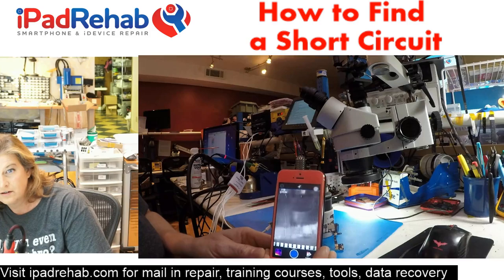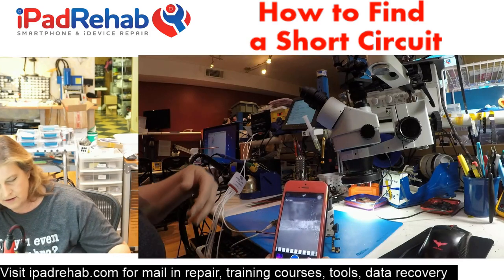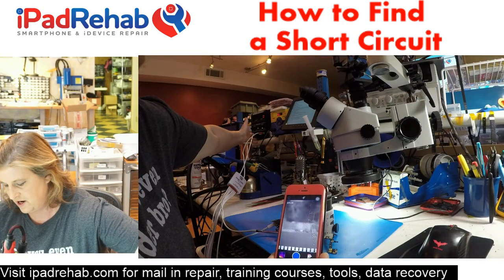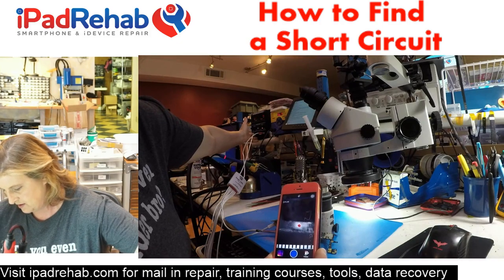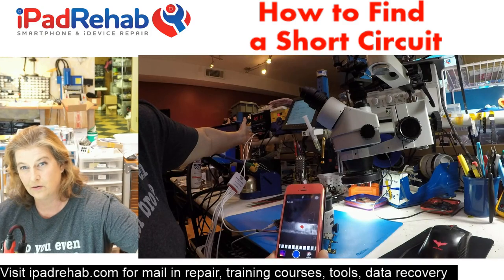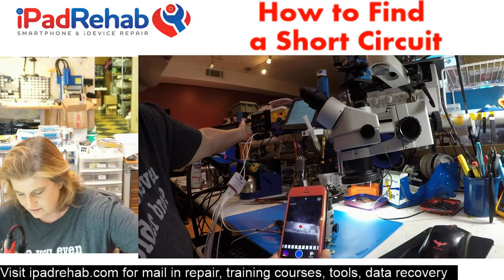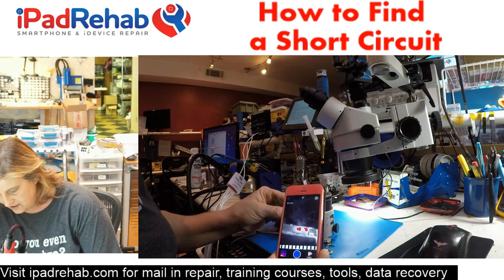All right. Ready? One more time. Let's look at that board. And DC power. I don't know what that is. There's a hot spot. Is that the PMIC? It looks like it's a little bit north of that. I can clearly see the PMIC. I'm going to turn it off. I can clearly see the PMIC is right here. I'm touching it.